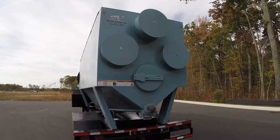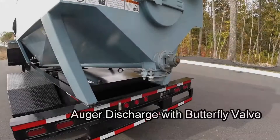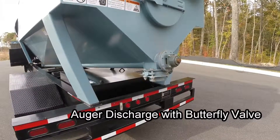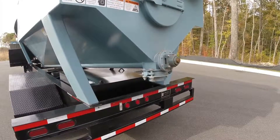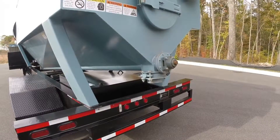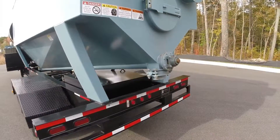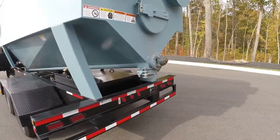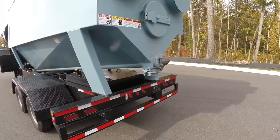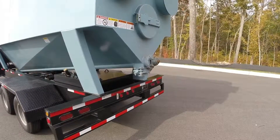There is an additional quick open access located below the inlets to easily clean that internal wire screen. On the bottom rear of the hopper, at the end of the trough which houses the single inclined auger, is the manual discharge butterfly valve. The incline gives the discharge valve the height needed for a 55-gallon drum or other standard receptacle for the dust discharge, without the need for secondary augers or other moving parts to make maintenance more difficult. With the supplied drum lid cover, the valve can remain open and will dump dust continually with no vacuum loss while the unit runs, eliminating any dust buildup in the hopper and keeping the auger clear and accessible.